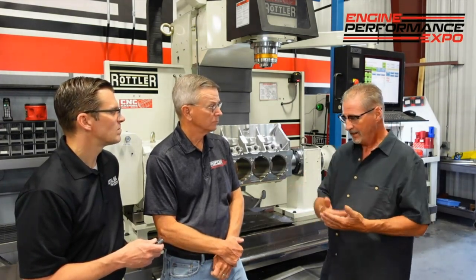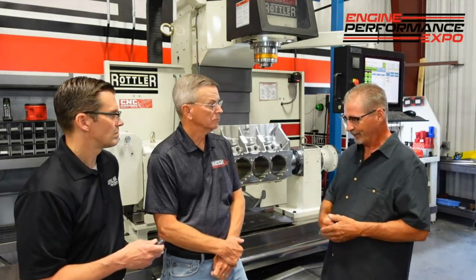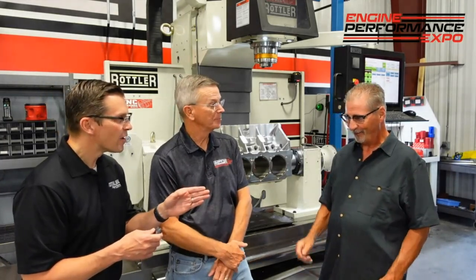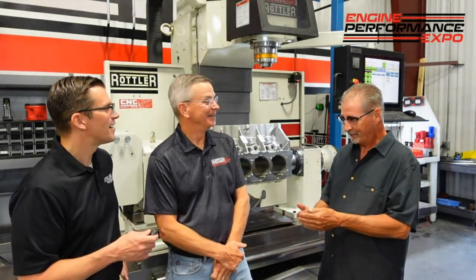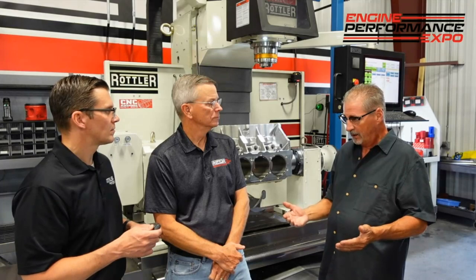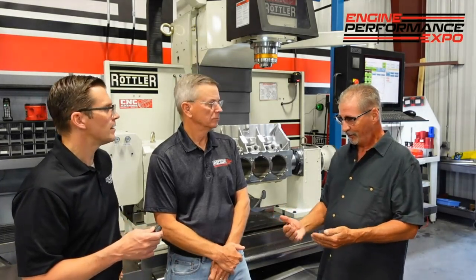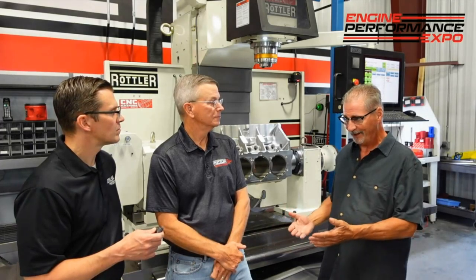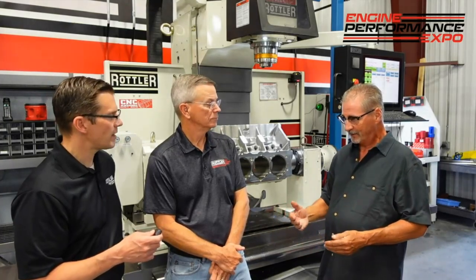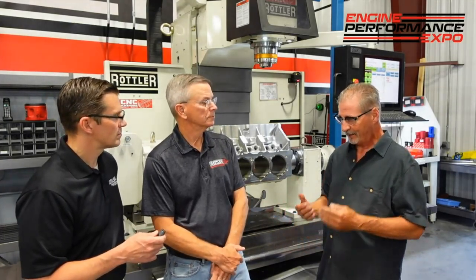That's where you've got to pick up your speed. You've got to gain knowledge as you're doing the process — make sure your holder is properly placed, the insert is properly locked in. You said cutting too slow — we never say cutting too slow. Sometimes if you're going too fast, you wear your edge up and didn't get the value out of that insert. If you're cutting too slow, you're not putting enough chip load on. You've got to pick that up so the chip load comes off properly and you get a better finish.